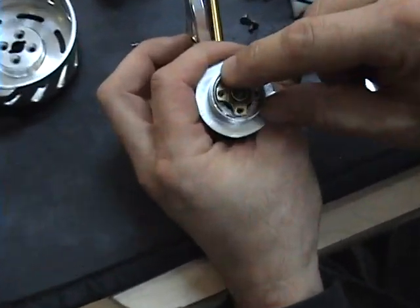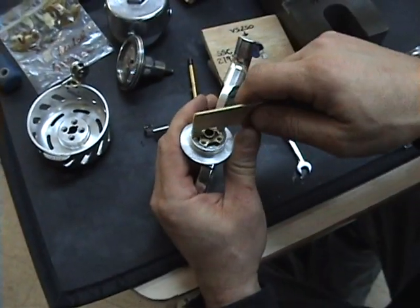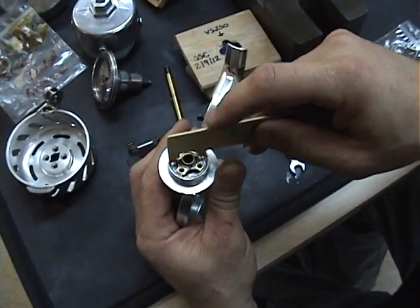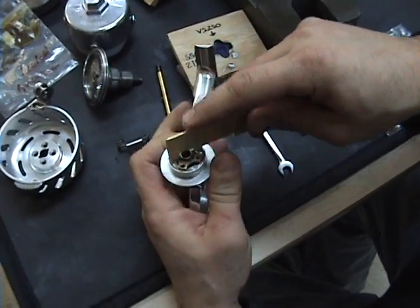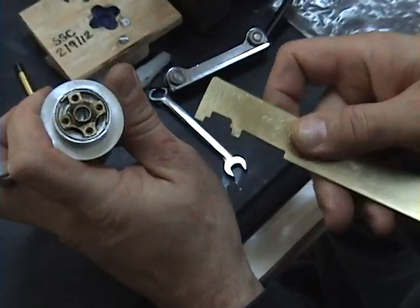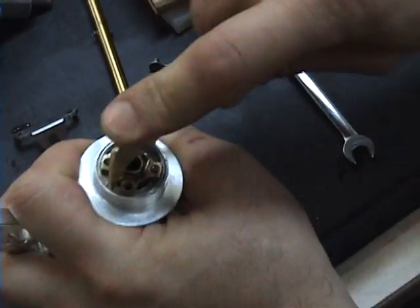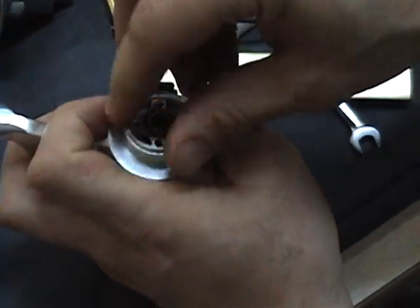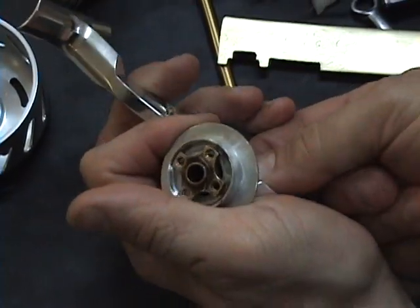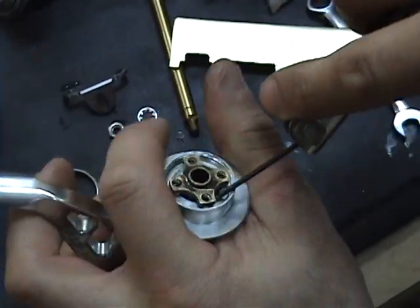Now what we need to do is get this piece off here. We're going to use the wrench that we made — put that in the key slot. So you slotted that out of brass? Correct, and then that's going to go right onto the key spanner type wrench. It's going to go into those two groove slots. You're going to turn like a regular screw, going counterclockwise, and once it's turned hand-tight the ring comes off and you can pretty much pull this one off.